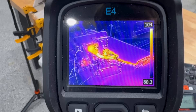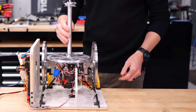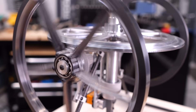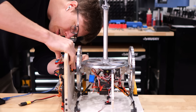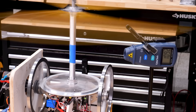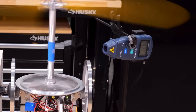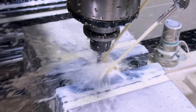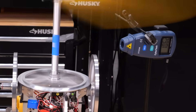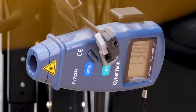Something really weird is happening — I can only get to about 30% of the target speed, and even at that level the motor is completely maxed out, melting wires and burning up speed controllers. My guess was too much friction, so I swapped the bearing grease for light oil — didn't make a difference. I spent ages adjusting the gear fit — didn't make a difference. I got a bigger motor — didn't make a difference. I redesigned the coupling between the motor and flywheel — didn't make a difference. I got an even bigger motor — still no difference.